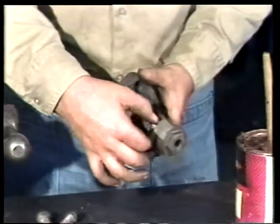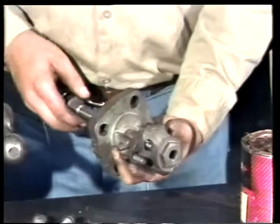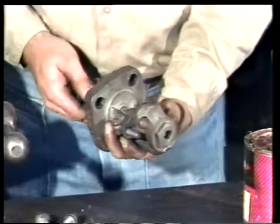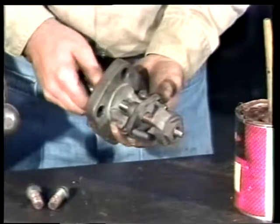Once these parts are lubricated, put the stem through the bonnet and slide the two-part packing gland over the stem. Then carefully thread the stem through the yoke bushing. Continue turning until the valve is near the full open position.